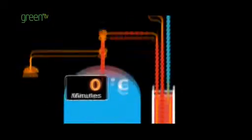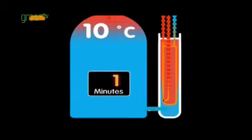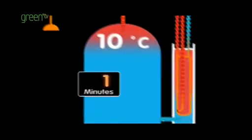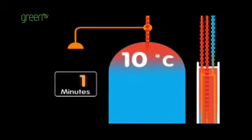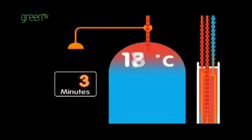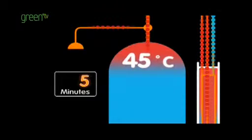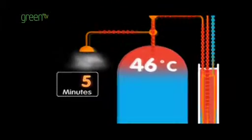Hot water, as it's heated, rises, and as it rises we're creating displacement of water in the bottom of the cylinder, which draws the hot water down into the top of the existing cylinder where it layers like cream in the top of an Irish coffee. That process continues throughout the day until eventually your entire cylinder is full of hot water.